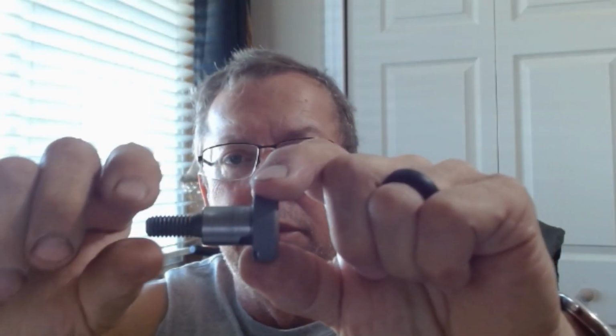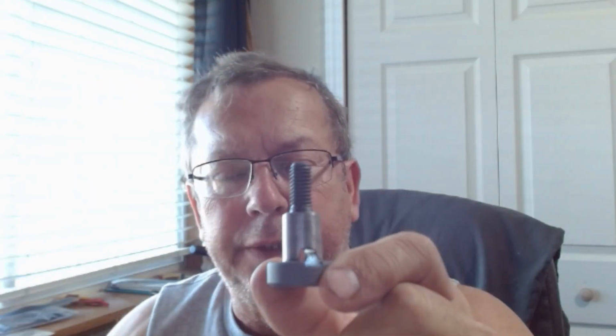And the things I didn't show was with this upper portion. This is half of the ones that I did. All I did was, actually, I parted this one off, so we end up with 3/8 of an inch thick, a little bit of a bevel. Then I went back and just filed a square hole in it. I just took a standard file, needle file, quarter inch wide roughing file, and just squared up that hole, which doesn't take too awful long at all, until I get a good fit with the quarter inch tool bit.